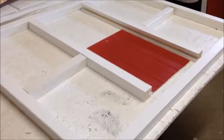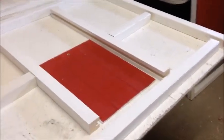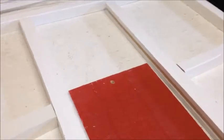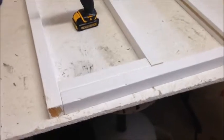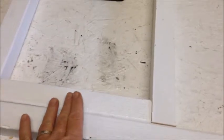The front panel has two 30.5 inch pieces, two 33 inch pieces, two 27.5 inch channels that have the dado in them, and two 10.25 inch pieces. Build the outer frame of the front panel first, then use the 10.25 inch pieces as templates to show where to drill in the dado pieces.